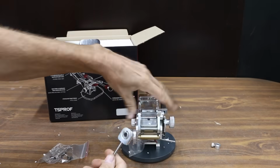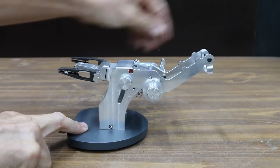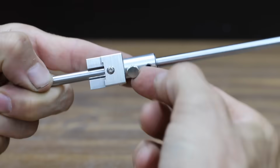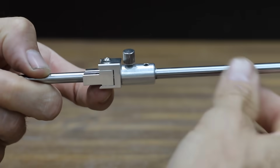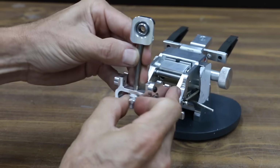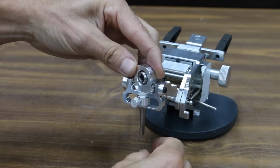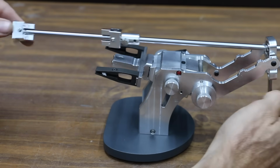Open the hinge joint to the working position and, overcoming the resistance of the spring, turn the lock counterclockwise until it stops. Insert the abrasive holder into the coupling and secure it with the screw. Remove the bushing from the hinge axis and install it in the groove of the hinge support. Align the holes of the bushing and the position of the stand. Pull the hinge down until it stops and tighten the bushing screw. Insert the assembled abrasive holder into the hinge joint.